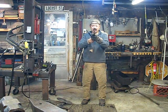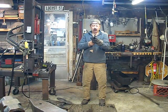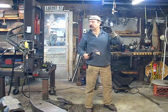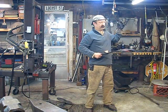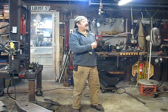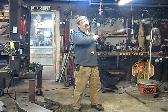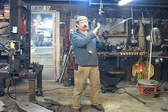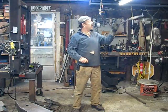And the best way, I'm pretty well pleased with what I can see right here. If you ever have any real issues and wondering if your blade is straight, it's great to do it on a day when there's no clouds. You take it outside and you point it at the sky. When you have a huge vacant background, any distortion or disturbance in the symmetry of a blade, you can see against a bare sky. Try it sometime.